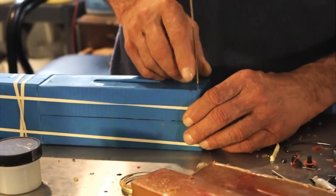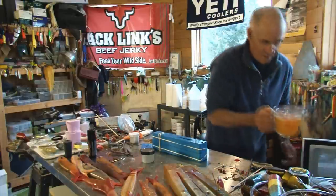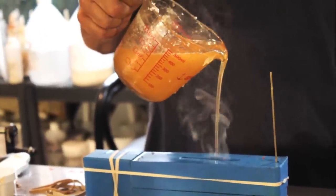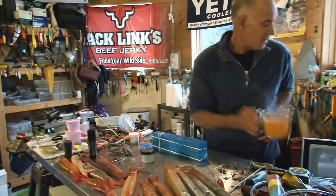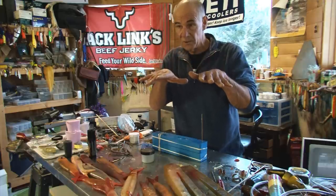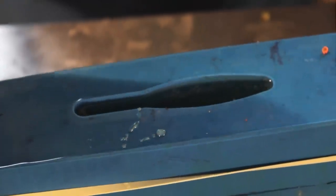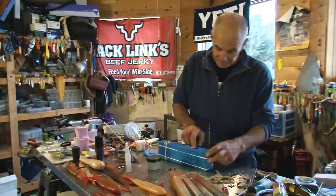Just to make absolutely certain that my screw eye is in place — make sure I put a pin in — my screw eye is in place. Make sure your plastic is really hot, and I'm just going to start pouring. When you're pouring a relatively large mold like this one, when you do your first pour you'll see it comes up pretty well even with the top. But as you sit and wait and it begins to cool, it's going to drop down a little bit. So you want to be ready after maybe two, three, or four minutes, as this thing drops down, to top it off a little bit. You can see it's reduced down a little in there, so I'm just going to pour a little more.